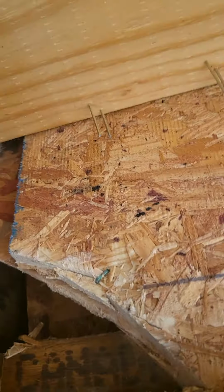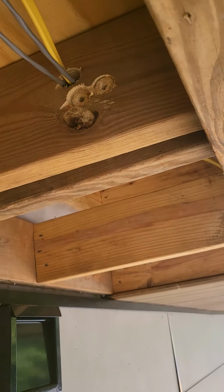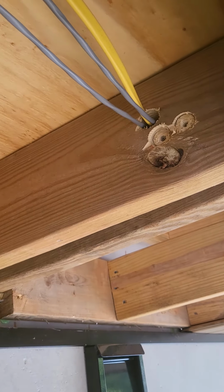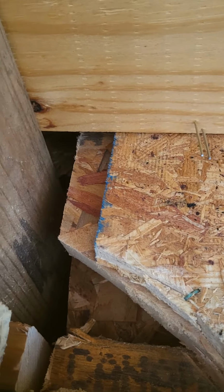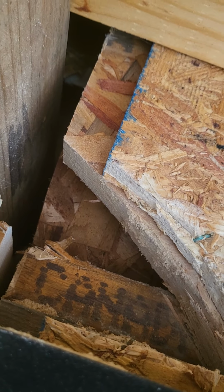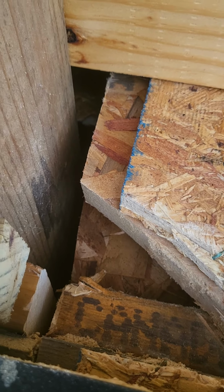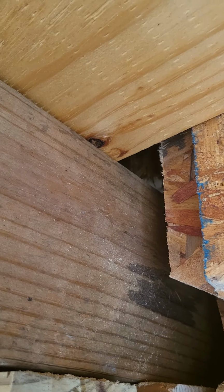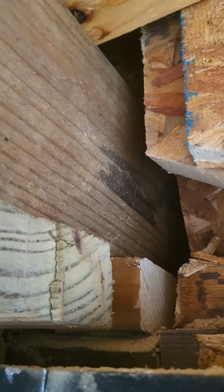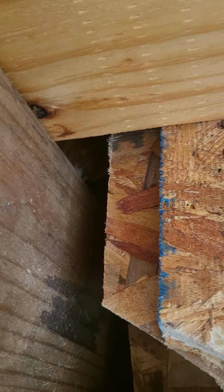So apparently what he has done, I guess rightfully so, he didn't figure he could hold a 2-foot flat roof cantilevered off the side of the house without, not cantilevered, bolted to the side of the house. So he cut through the sheathing, through the 1-inch rim board, through the 16-inch TGI. I figure that's 5.5-inch, 2x6, 1.5 inch there, and I'm guesstimating 1.5 inches up there.